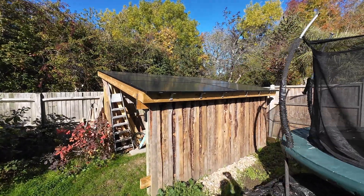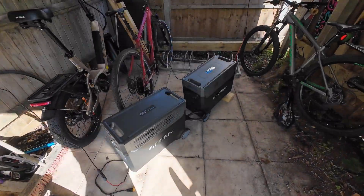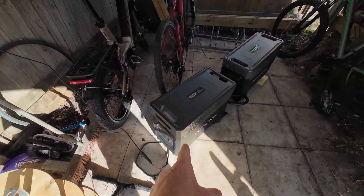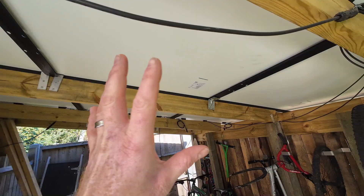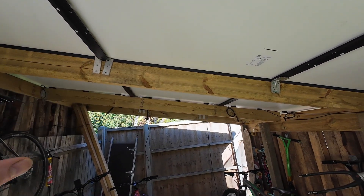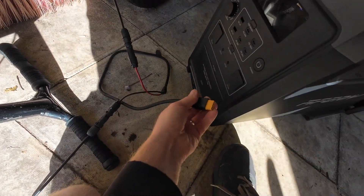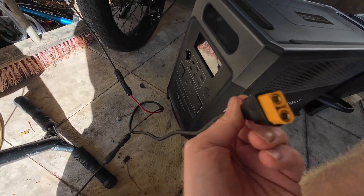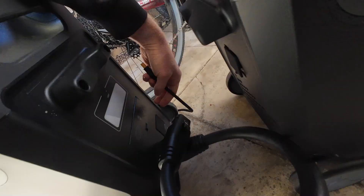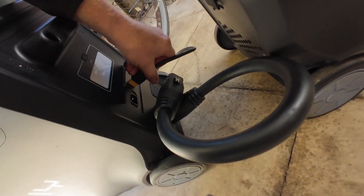Come with me to the solar shed. Previously we tested a single unit hooked up to four panels — that's two in parallel and then two sets of parallel into series. We're going in via an XT90 connector.